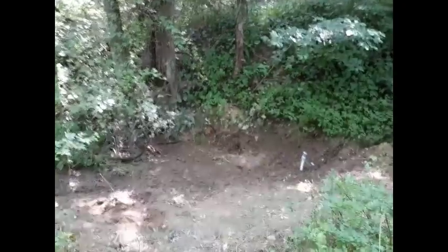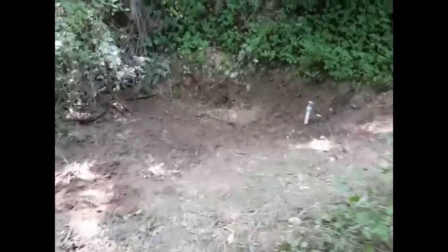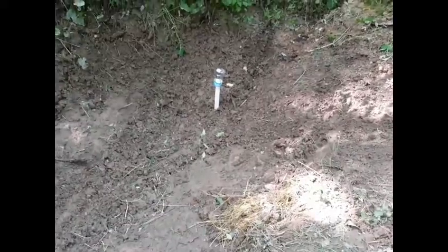I worked until dark last night, finishing up our spring connection. And we had the water going pretty good for a little bit, and then all of a sudden it stopped. Well, it turned out I created a vacuum, like closing off the end up here. Let me show you. Here's the site of all the excitement and activity yesterday and past week or so. I had to add a snorkel because it got airbound.